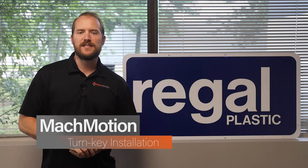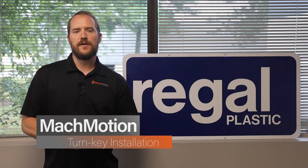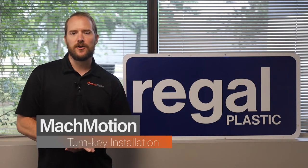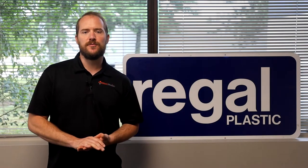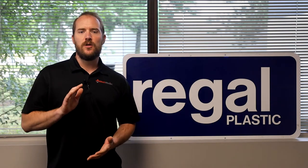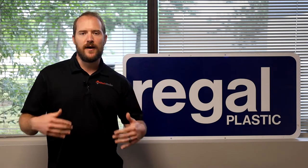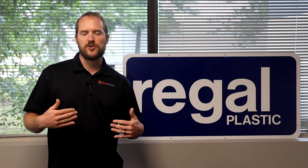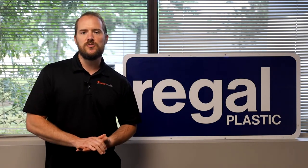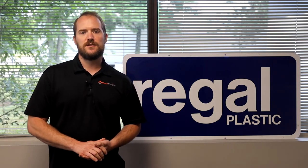We are at Regal Plastics getting ready to do a retrofit recontrol of a Thermwood ES82 router. It's a dual table router with four spindle motors. Today we're going to decommission the old control, take out the old electrical enclosure, and start simplifying the machine by taking some spindle motors off, switching to a new spindle setup with VFD, and adding an automatic tool changer.